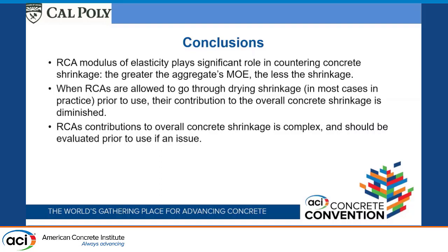It wasn't the moisture content. Or the drying condition? Well, that was something that was strange, and I don't have a right answer. When we made our own aggregates, we processed them differently. Some were saturated and kept saturated, and others were dried. The ones that we dried out ended up coming out with really low modulus of elasticity. I don't think it has to do with that drying process. I think something else happened during the manufacturing.